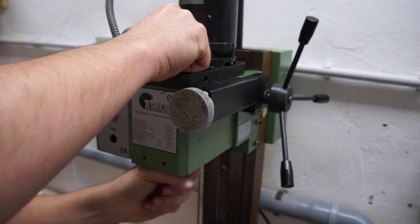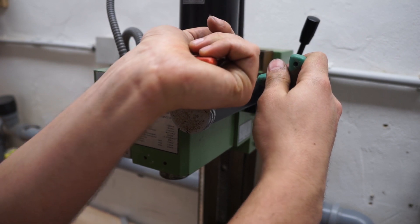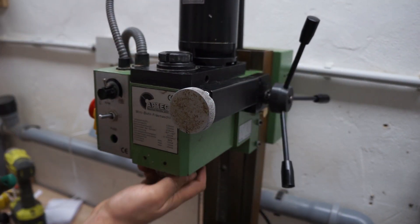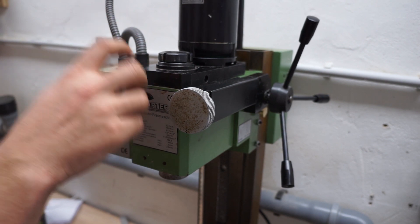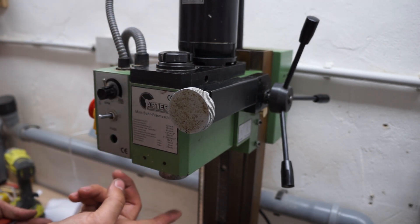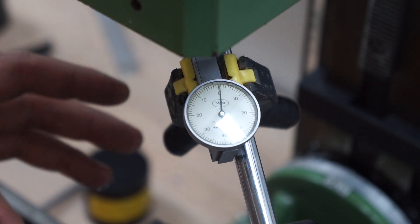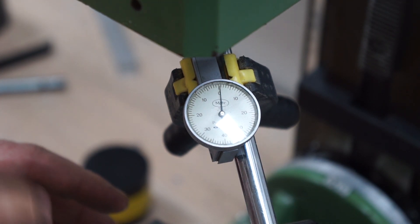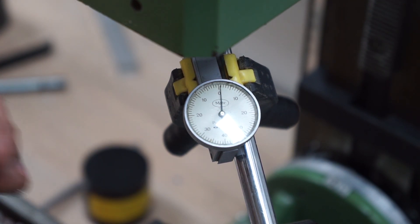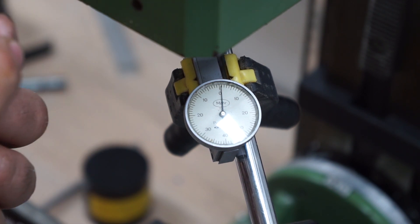Each time I get a tiny bit confused because the left-hand thread is unnatural. Tighten it a lot — now it's very hard to turn. I think what's happening is the shaft is a tiny bit too thick, so it's very hard to actually press down these bearings. Let me put an indicator in the bottom of the shaft and see if we get any movement in this direction. Showing the dial indicator in this direction doesn't really make sense since there's enough flex in the machine itself that any force here will give you a reading. But I did go back and tighten it a whole bunch more — with a bit of extra force it actually tightened fairly well. I tightened it to a point where it was just too tight to turn, then turned it back a slight amount and let it run for a bit.